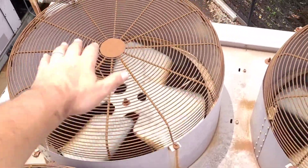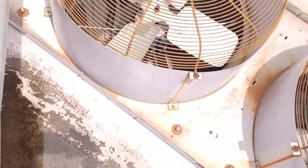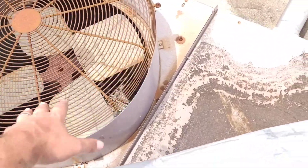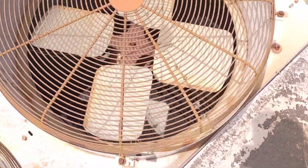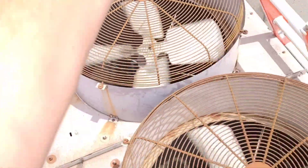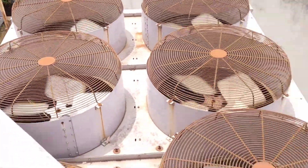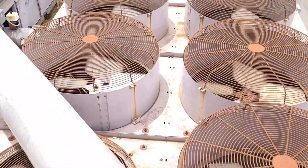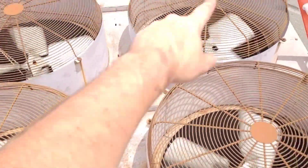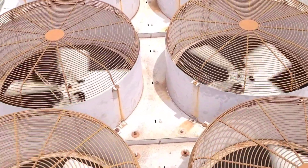All the fans are running. This one is slow — these are like that because of the motor masters, which are actually spinning backwards to begin with. I don't like that; that motor master must be wired backwards, we probably need to switch two wires there. This should be circuit A fans and this should be circuit B — it goes one through ten, so odds are circuit A, even through circuit B on these particular chillers. Alright, the fans are good.